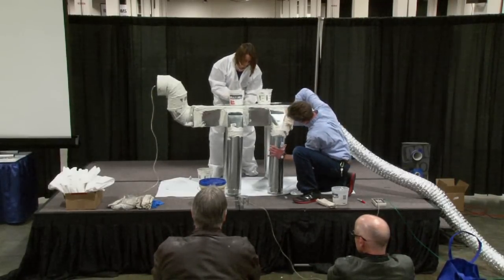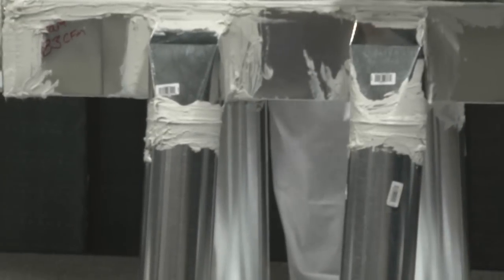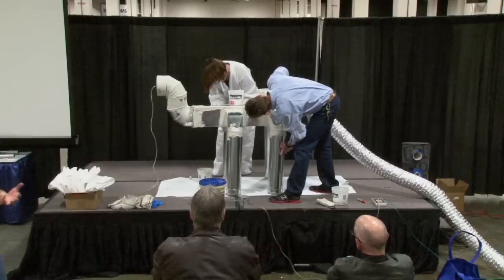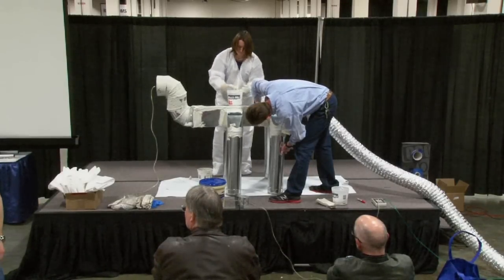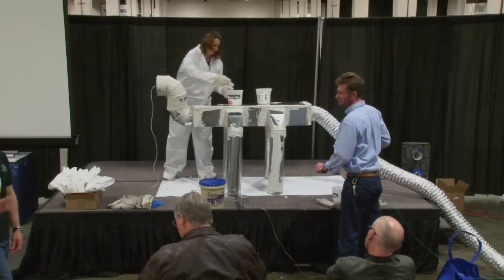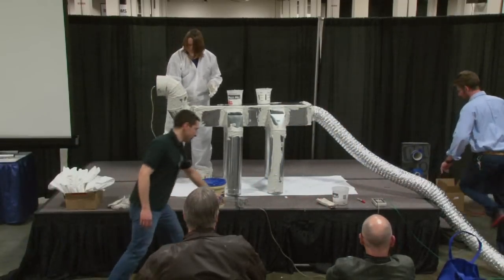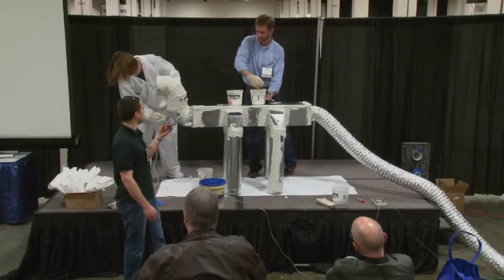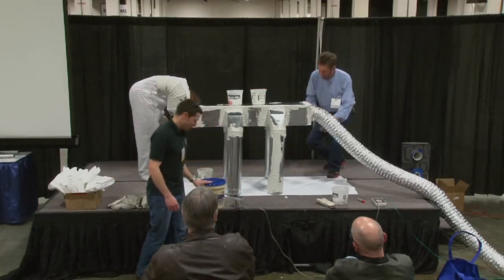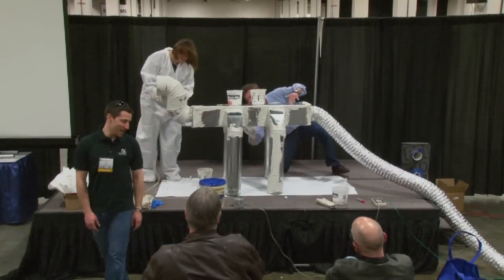There are different kinds of connections. The ones we have right now are a crimp style — we really used it just for the leaky factor. They also have a peel-and-stick type, and even though you think the peel-and-stick membrane is solid, you'd still want to hit it after the fact. On price difference: a roll of this tape is typically $28, and it covers about 100 to 120 lineal feet. This same bucket of mastic is also 28 bucks, so you'll go a lot further with the mastic applied.